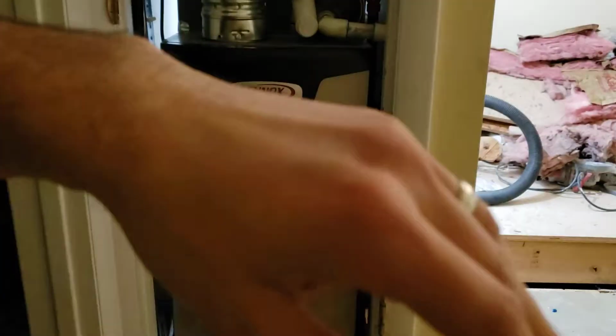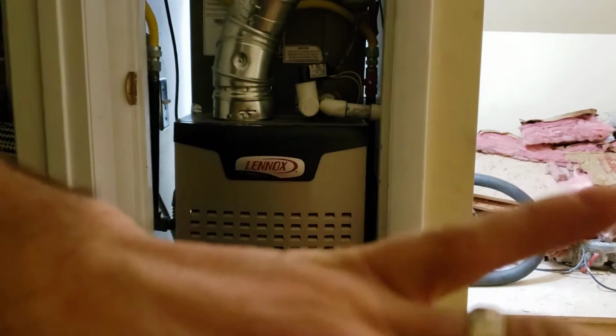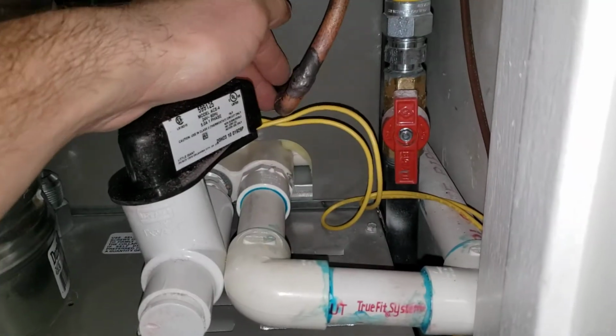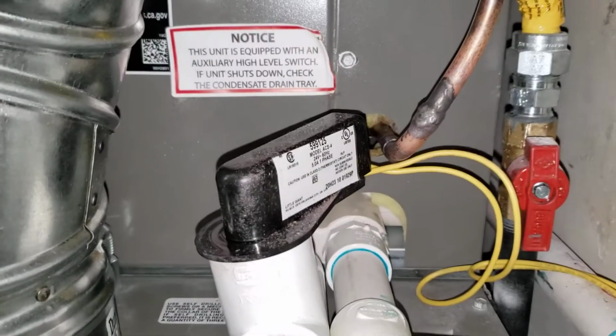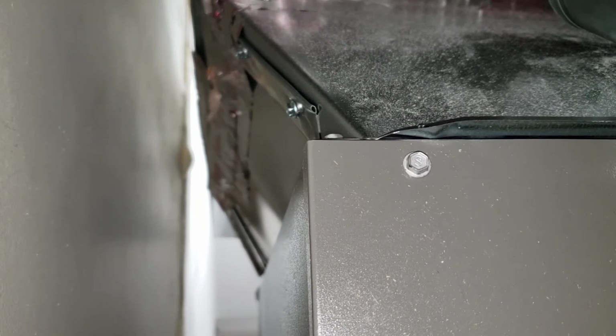This is completely non-functional. I mean, okay, I'm back up as far as I can here with the subfloor, and I can feel the air flowing, and I'm 4 feet away here, and I can feel the air still coming out of here. Okay, I mean, right here, it's billowing out from here, from here, from here. But there's supposed to be some rubber grommets that cover around these. They're not here. They're not anywhere that I know of. Obviously, big gaps all the way around up here, there. You can see airflow there, and that's supposed to be the closed system, pushing that air through the ducts. See the gaps.